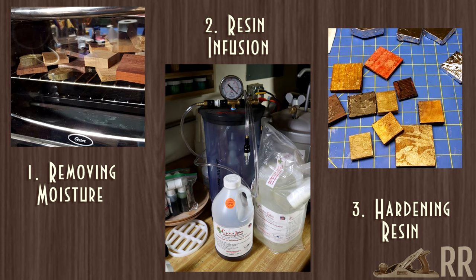Preparation for this week's project is a little involved, so I wanted to take a few minutes to go over the process. First I cut up some small squares of wood the appropriate size for ring blanks and threw them in my toaster oven for 24 hours at 215 degrees. This removes all of the moisture from the wood. Next I took those small blanks, dropped them in a container full of cactus juice and first put it under vacuum until the bubbles stopped coming out, which means all the air had been removed from the wood, and then let it soak for about twice that long.